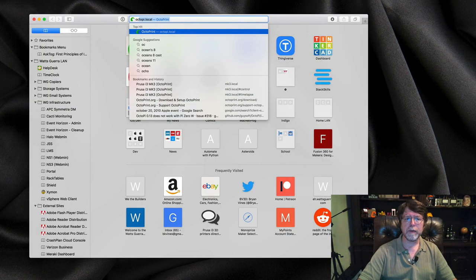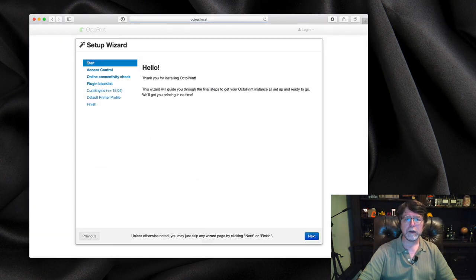We've got the Raspberry Pi plugged into power — that's literally the only cable going to the device right now. We need to find it on the network. Because OctoPi includes a pre-configured zero-configuration networking protocol, Bonjour, we can find it by its name. The default installation is simply named octopi.local. Type that address into your web browser and, if everything has gone according to plan, you'll be communicating with OctoPi running on the Raspberry Pi.